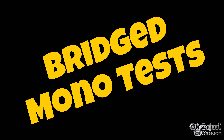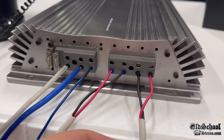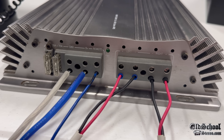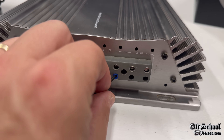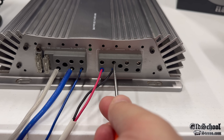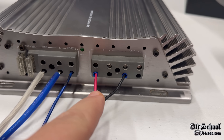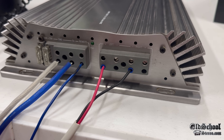Let's bridge the amp for mono and talk about how that's done. These may be some of the worst terminals I've ever seen for the speakers and also for the power and ground. It says it'll fit 10-gauge, but it's really difficult — I used 8-gauge and shaved it down for the dyno test. The way this thing works is goofy because it's not intuitive: you unscrew a screw above and then remove it below. If you want to bridge it, simply go from left positive to right negative — that will bridge the amp for subwoofers or a single speaker.